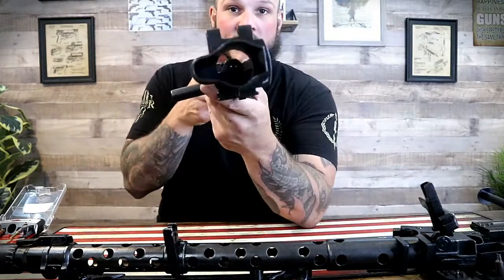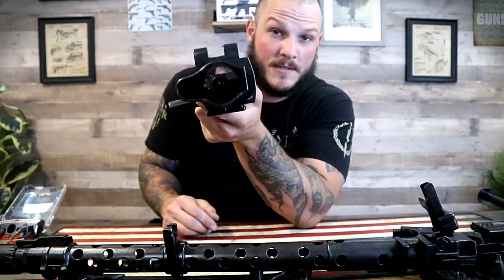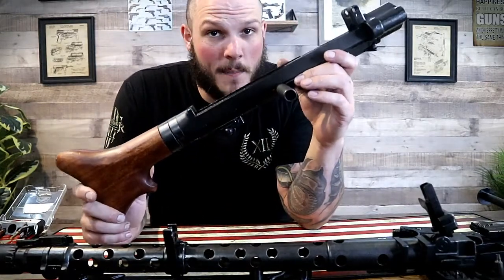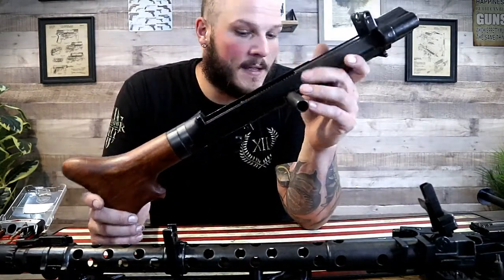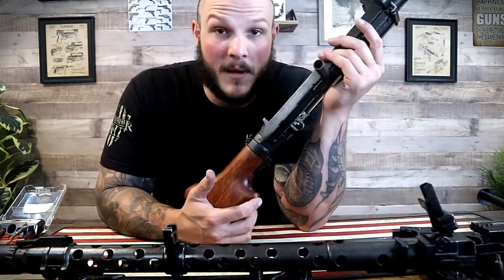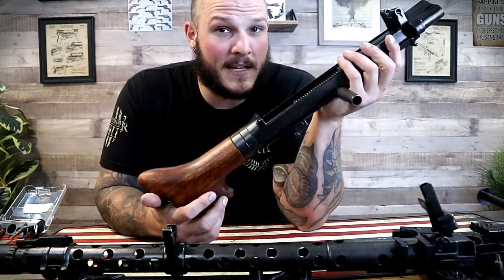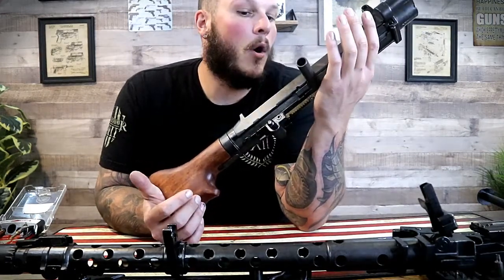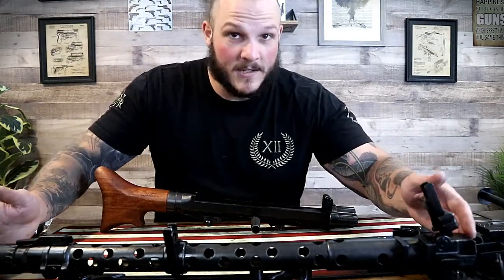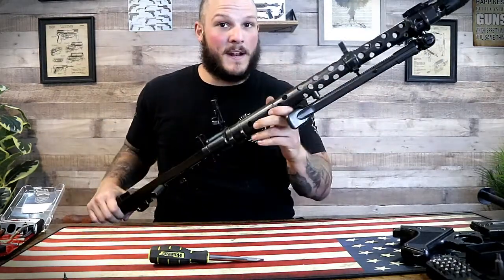Now with that being detached, I'll start sizing up what I can fit in there. This looks like I have about enough room to do a traditional .223 AR, so this may just be an AR base. I initially tried dropping an AR-10 barrel in there, but the gas block keeps getting caught up on one of these seams. I could either use an end mill and try to mill it out a little bit, to give me a little more room, see if I can get the gas block in there. I could try to find a low profile gas block for an AR-10 .308, or I just go with the traditional .223. One issue I'm going to have with that is how long this gun is. From the muzzle to the receiver, we're looking somewhere around a 28 inch barrel.